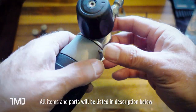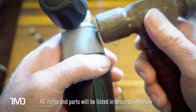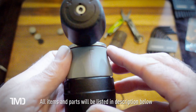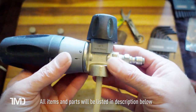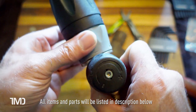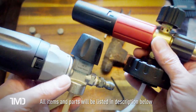Reinserting the MTM linchpin: again, make sure you can see both linchpin holes on top so you're inserting it the right direction. Tap it into one side, and if needed, turn the unit perpendicular to the adjustment nozzle on top for easier pushing. A small ball-peen hammer can help push it in the final bit. The linchpin is pushed in all the way, slightly recessed on both sides — the filter is changed on the MTM PF-22, and all dials work properly.